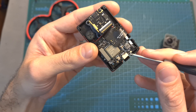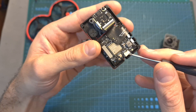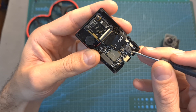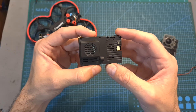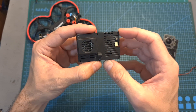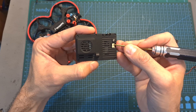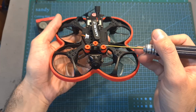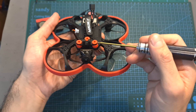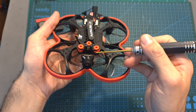If you are unable to solder back the GST connector, which is not a very easy task — and I recommend doing it with caution — you'll be happy to know that on the camera board itself you can find DC input and ground pads so you can solder wires directly to those pads to power the camera. I'm going to report this issue to BetaFPV and Insta360, and I hope on the next version the issue will be resolved and that they provide an option to purchase a new back cover that covers the four-pin GST connector for better security. As for preventing the camera from flying away, I recommend using dental floss on the silicone dampers so they are more secured and the mount won't easily separate from the drone.